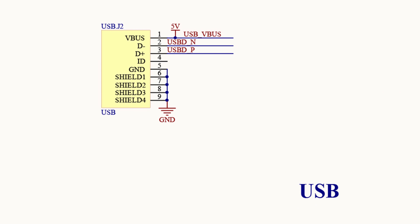There's a representation for the USB port in the schematic. When I first got my hands on this board, I was wondering why there are interfaces for both USB and UART — why two serial connections? This was answered by reading the SIMCOM 7600 documentation. The 7600 can accept AT commands on either interface and perform data transfers over either interface. The USB port is set to suspend if it's not used within some period of time and becomes active again during certain wake-up events.